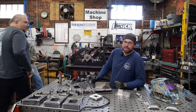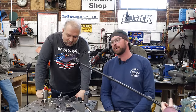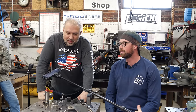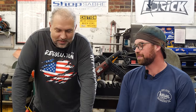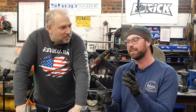Well there it is — welding titanium. Not as hard as you thought it was going to be, not at all. Really, based on what the welding experience itself was like, I would say the harder part is going to be in the prep, in the cleaning, in all that stuff. It always is. And the really tough part about it is the cost. Everybody wants a titanium intake until they see what it costs — then aluminum is just fine. That'd be the upsell: with these new settings I'll show them what my aluminum welding can look like.